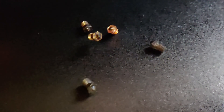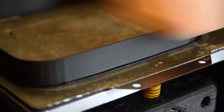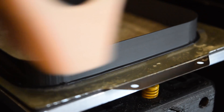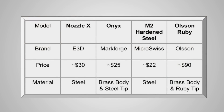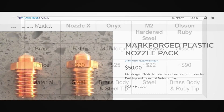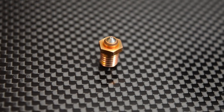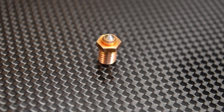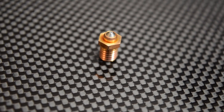So knowing all of that, what should you do with this data? My opinion? Don't do anything. All these nozzles basically perform the same. If you're trying to push an extra one or two millimeters cubed per second, don't bother — just get a CHT. But if you need an abrasion-resistant nozzle, go with one from a manufacturer you trust or one in a price range you can afford. For me, because I print abrasives on a V6, I'm going to continue using the Mark Forged simply because it's brassed and will seal better against the heat break and prevent leaking. Thanks for watching.